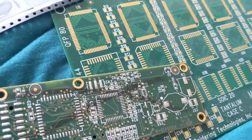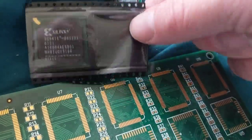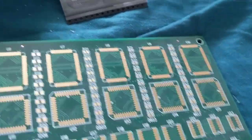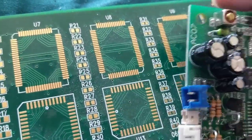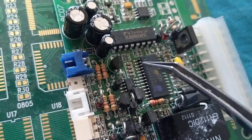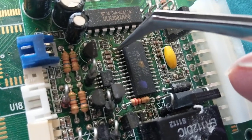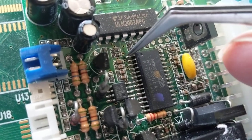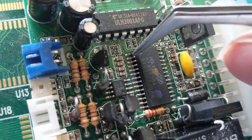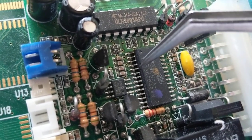Now, what's the point of all this video? What is the point? Okay? Let's say this is a practice board that you started with. The chips, as you see, and I'll show you in a video, these pins, see these pads? See these pins? These pins right here have to make contact with these pads. 1, 2, 3, all these are the pads with solder. They have to make contact.